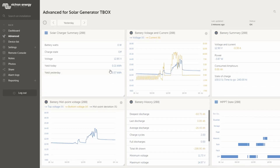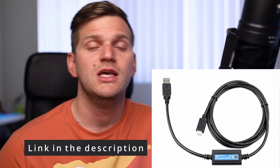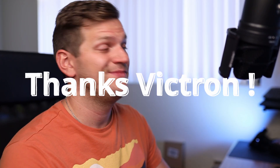This gives you a good indication of what happened to your battery and how full it is. It's a really cool dashboard — you can log as many days as you want. With the Raspberry Pi running the open source Venus OS, you don't need to buy another component except for the USB connection cables that connect from the Victron components to your Raspberry Pi. It's pretty user friendly — they did a great job. Thanks Victron! If you have more questions about what I can show or explain, let me know. Thanks for watching.